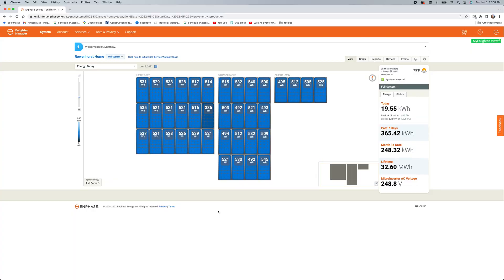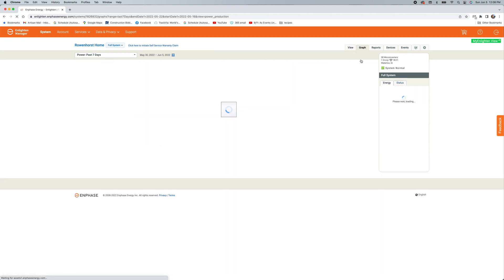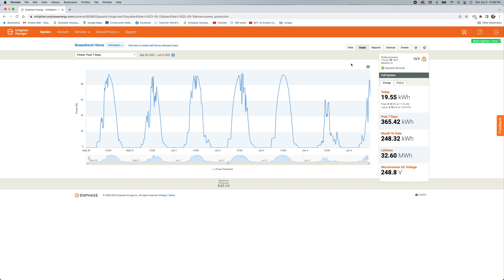That's what I used to look at before I got the Tesla app. Here's a quick look at the Enphase software - it's cloud-based so I can log in from anywhere. It shows my three arrays: the garage, the shed, and the addition. There's one panel that's always a slight underdog because it gets some shading from the garage overhang. It shows panel by panel how much each one is producing, and you can pick different time periods. There are graphs of the last several days - a perfectly shaped arc means a clear day; jagged or missing parts means clouds.